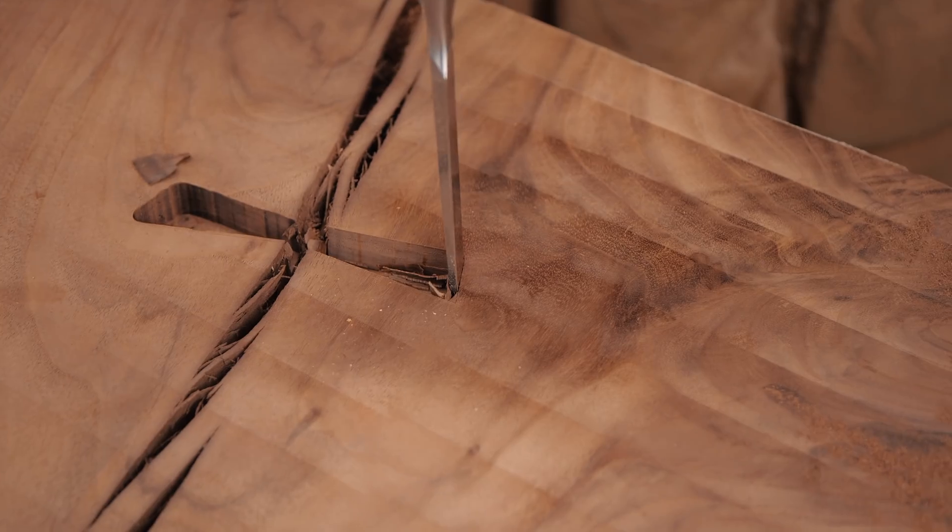Once it's dry, I highly recommend finishing it with a hand plane. If you're not comfortable with your hand plane, get as close as possible — if you try to sand off a ton of material, it'll take forever and can round it over, leaving a low spot. I'm putting in my butterfly keys before any sanding on this slab; I've only flattened it, so anything else I do will take everything down evenly. One important thing: always cut your butterfly keys out of long grain across the crack. Cracks run with the grain and want to expand and contract that way. Long grain across the crack holds it because long grain doesn't expand and contract that direction — that's what keeps the crack from getting bigger. If you want to support the channel, head over to the Katz Moses store for an apron, dovetail jig, or stop block. Thanks for watching, stay safe in the shop.